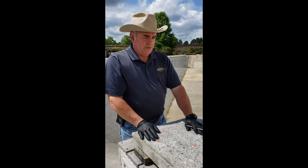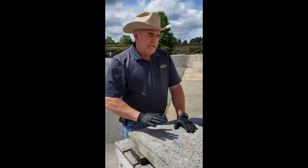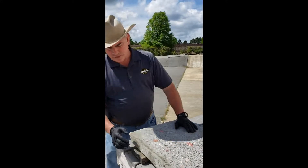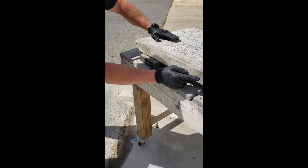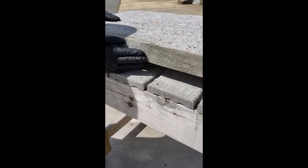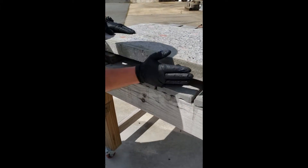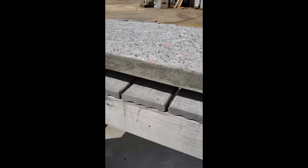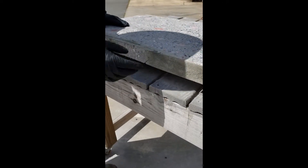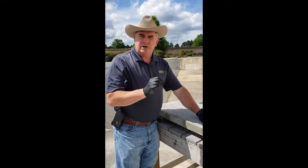How do you get a slurry coat? First of all, let's look at why you can't just go buy any material and slap it on here and let it dry and start polishing. Look right here on the front — can you see these surfaces? This is a very fine material made for feather edge to half-inch concrete repair. I put it on the face and you can see the larger sand granules popping out when I wipe it. That surface would block filling a lot of these holes — those sand particles are in the way.